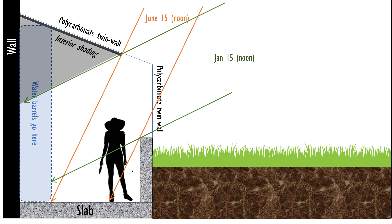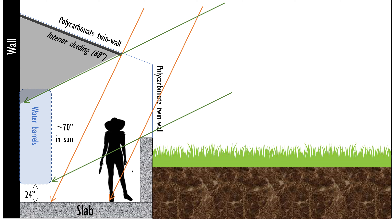I want to put shading material on the inside of the roof once and leave it there — I don't want to adjust it every month or season. So I need to understand what happens on January 15th if I put the shading where I just drew it. Going back to the green arrows, with that solar shading on the roof I end up with less sun getting in on January 15th, but I still have a good section from about two feet above the floor and about 70 inches above that with full sun hitting the back wall — and that becomes the logical place to put my water barrels. With the barrels being three feet tall, if I stack them two high and place the bottom barrel two feet above the floor, I should capture the entire section of wall that benefits from solar gain in January.